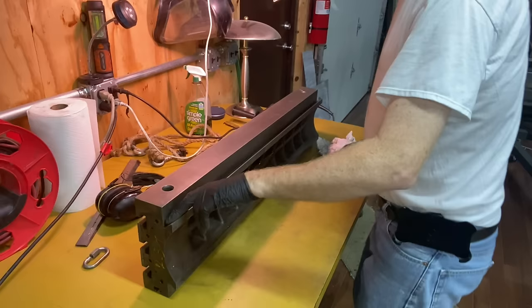I've been saving some of the grinding dust from various grinding sessions, and I thought I'd try putting it inside some epoxy to make it look more metallic. It has a lot of dirt and debris in it, so I put a magnet underneath — you can see it makes it all stand up. I bang it and a little puddle of rusty material comes out. I guess rusty iron oxide is still magnetic. I've been getting quite a bit of debris out by moving the magnet around. I have this two-part epoxy calling itself steel weld — it's not — I've got it mixed up with a gray color, and now I'm trying to mix in some of these shavings. I've never done this before, so I don't know how it's going to look. That looks fairly saturated to me. Now I'm going to try putting it on the table.